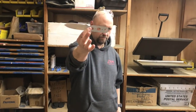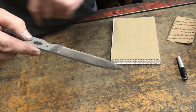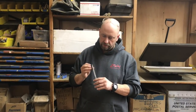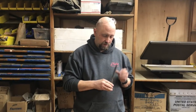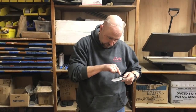Here's a brand new knife, no scales obviously, that I put a burr on. Can you see the burr, Michael? You see that faint white line there? If you take these three fingers and pluck it like this, you'll have a burr on one side and not the other because one side is going to grab your fingers. The other side, your fingers are going to slide right off, or you can just look down the edge and see that faint white line. That's the burr.